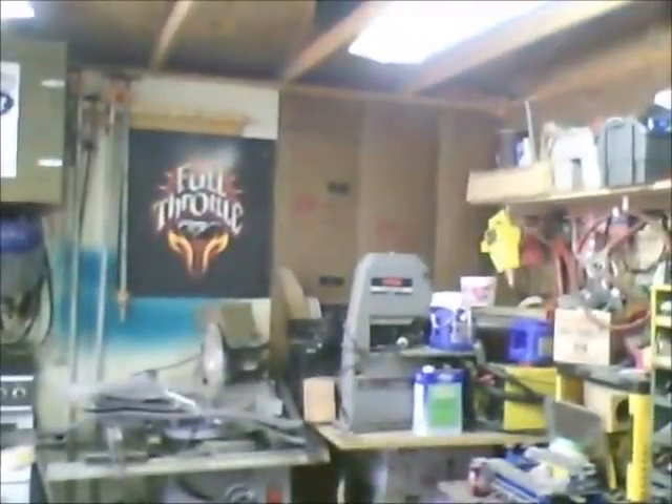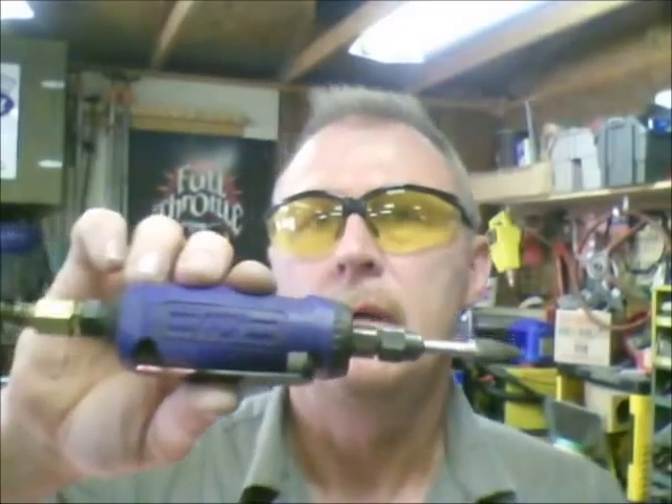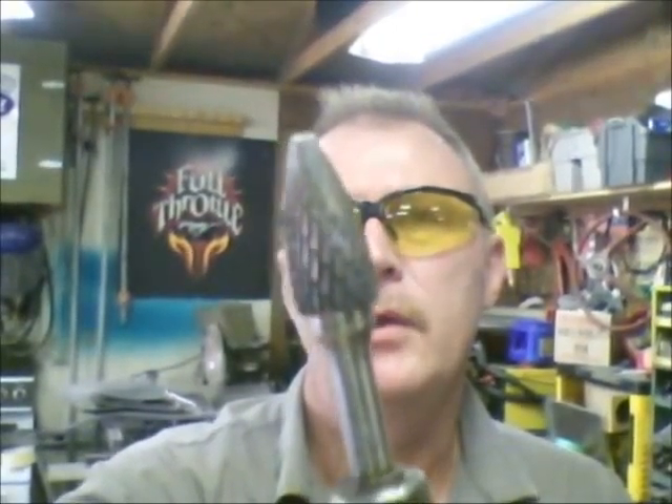Something else I noticed — I was watching Ed the Kid's video where he was working on the front end sheet metal and stuff around his grille surrounding and he was using a Dremel. Those work pretty good. I've got some grinding stones and stuff that I use in mine. But what I like to use in that situation is a die grinder with a carbide bit or a carbide burr in it. You can get them different sizes and they don't wear out, and there's not a danger of them cracking and blowing up on you like the abrasive wheels are on the Dremel. In my opinion they're a little safer and you can get whatever profile you like to go in there. This one's a pretty good size and it cuts real well. That's what I clean all of my welds and stuff up with after I'm working in the wheel wells of my car and tougher areas.